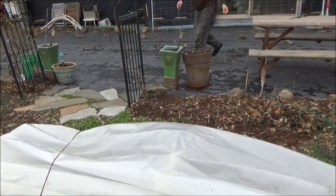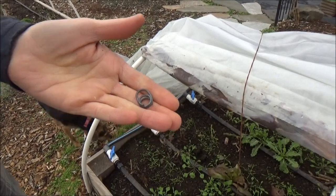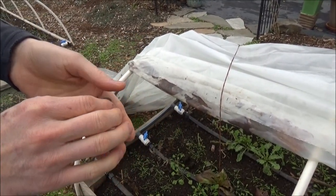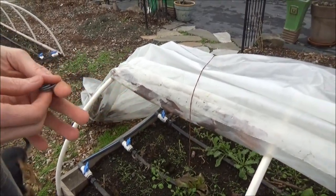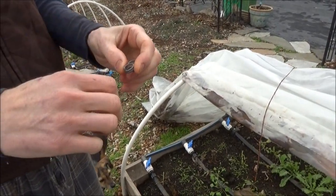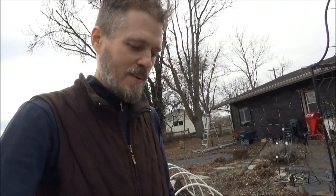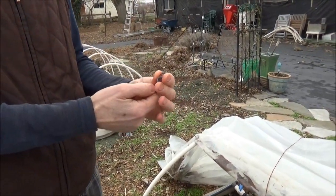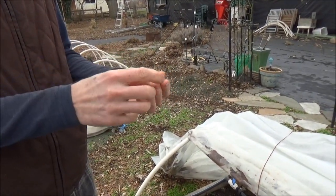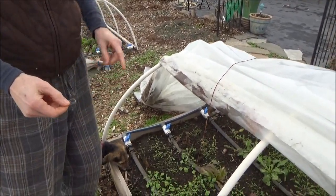So this is what I do. I take whatever — if you've got rebar, sometimes I use fiberglass poles cut short, like you would get at a fencing supply place. I'll sort of clamp it on there with fencing wire — mild fencing wire, not high tensile — and just wrap it around in a circle. Then I'll take another bar or rod, put it there, wrap it around that, go again, and snip it. Then all you have to do is put that on your rebar and do it every other one.